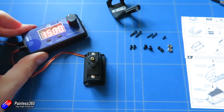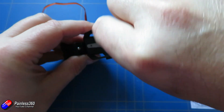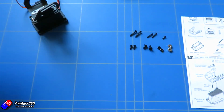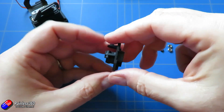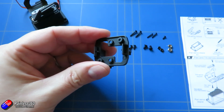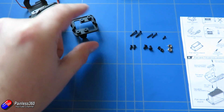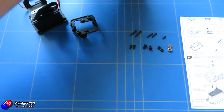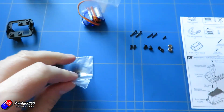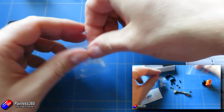Centre the servo before you do that, to make sure everything's lining up, then use the screw that comes as part of the servo kit to hold that control arm in place. That is the pan part all put together. Now you're going to have a couple of additional bits of plastic — this piece is going to hold the camera. There are a couple of ways to mount the camera: one is directly using the two holes in the corners for a traditional-size RunCam Swift or similar, or if you're using a smaller camera, the other two screws are there for the U-shaped metal bracket that you get in those camera kits.